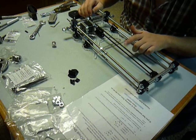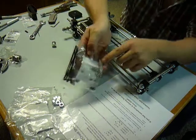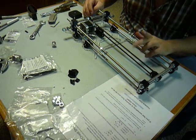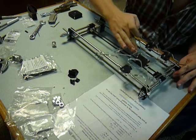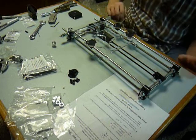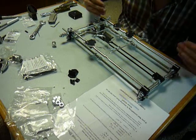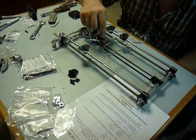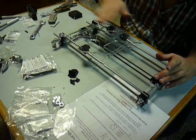You can tighten up one end and just kind of scoot the back until it's right. My belt's pretty tight. I know that this kit comes with belt tensioners — they're right there, I'll get those on eventually. But this sounds like a little rubber band at this point and it does glide with no real resistance other than the motor, and that's what they say to do. I did have to adjust the pulley and the motor so that it's in line with the belt holder on the carriage. Once you've got everything running smoothly, go ahead and tighten those down.